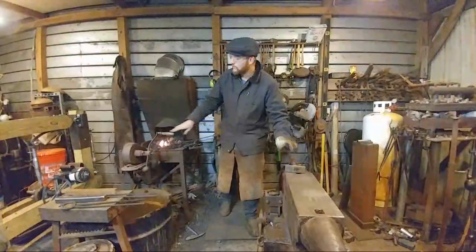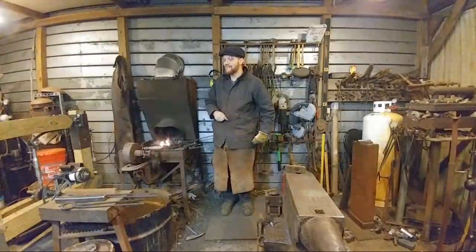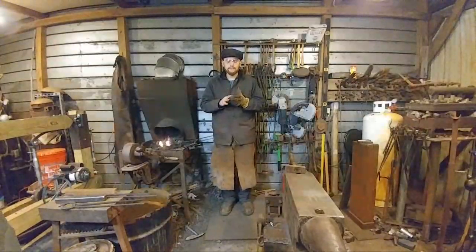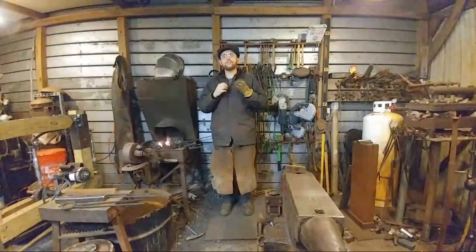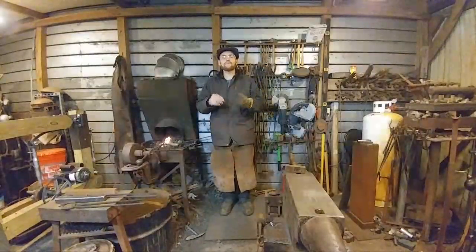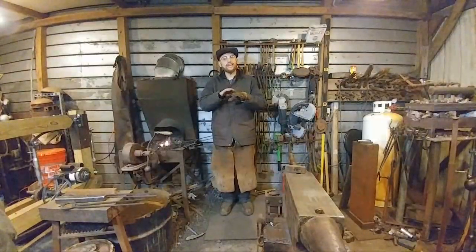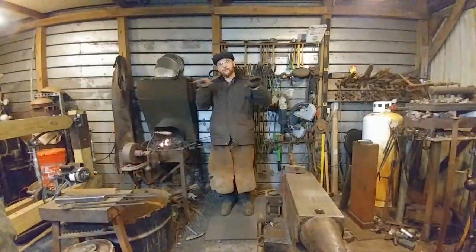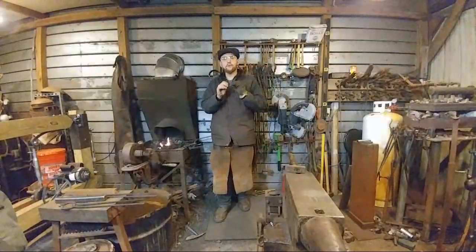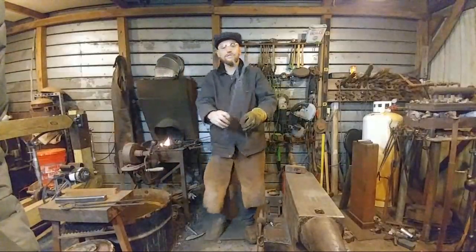The last tip for good clean ironwork, and I'll try to put this in a fairly lengthy video that everybody loves on my channel, I'll try to do an in-depth video on this. The last thing but not least is you need to finish out the heat. There's a finishing heat, and a finishing heat is between a dull red and a black heat. That is where you put in your last hammer blows, your planishing blows. You're not moving the material, you're just trying to iron out any little lumps and bumps or wrinkles that are in the material or any hammer blows that are left in it. If you do that at a dull red to a black heat, just in that heat alone, it'll really sheen up the surface and fix them up.